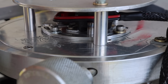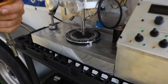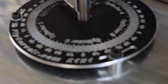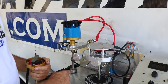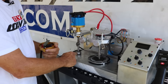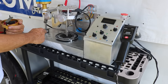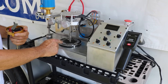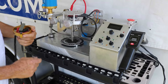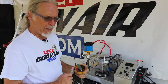This machine is how that stagger is set. The plates are tied into each other on the machine with the correct stagger that does not change. We can check it with a timing light and on the degree wheel. Once it's checked, it's installed in the distributor, locked down, and assembled and tested as a unit. These two pieces are driven by a tooth belt on the underside of the table — they are synchronous to each other. You can use the timing light, set the RPM you want, and check it right on the degree wheel, verifying the stagger between the two ignitions on the assembled unit. That's the last time it needs to be checked — you can just take it and stick it in your engine from there.